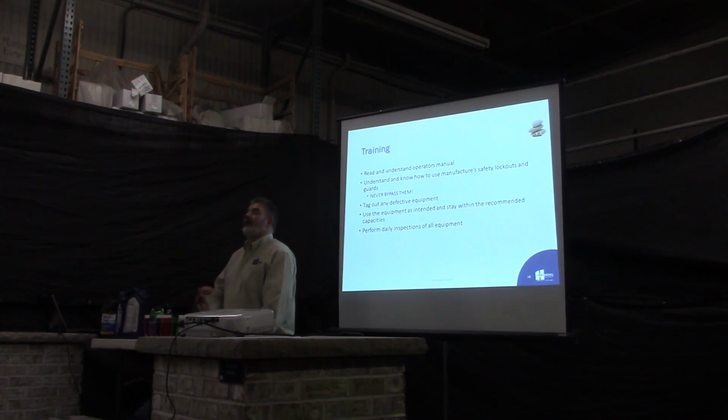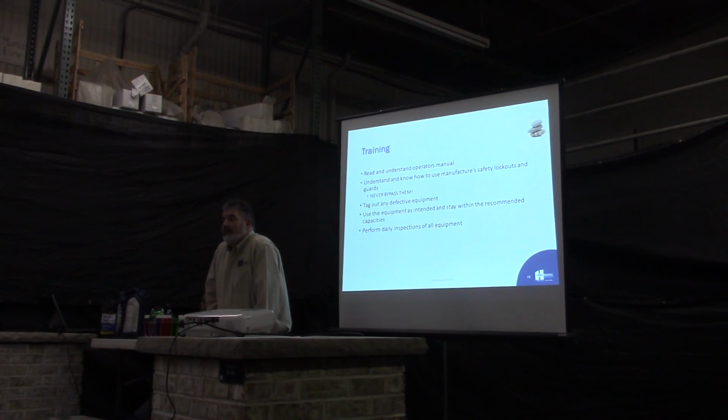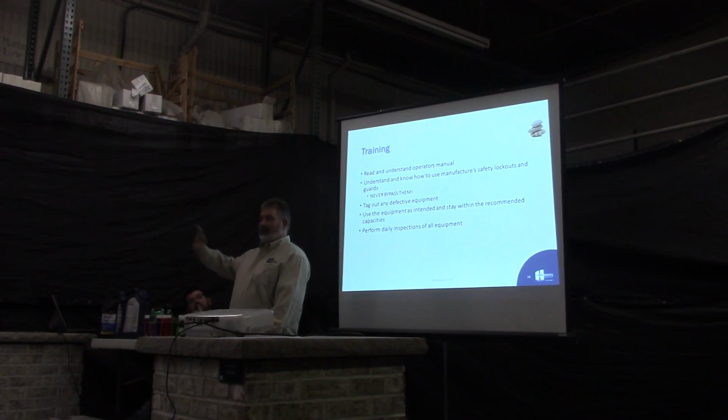Kevin? Sorry. Yeah, so if I'm storing my diesel machine over the winter, and I have the tank half full, what should I do? Just put some anti-gel preparation in it? It depends. If you're just storing it and never going to use it... Well, not over the winter. But if you're going to use it during the winter, it's a good idea, let's say in the fall, to throw some anti-gel in. It doesn't cost much, and it'll make it so that if you need to use it in the winter, it's ready to go.